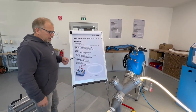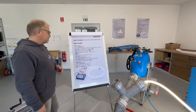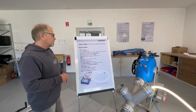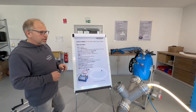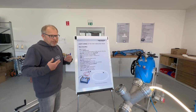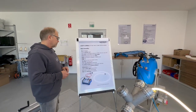We also made the standard E-modulus tests, and also here we have excellent results. All of them are more than 3000 newton per square millimeter. The TG is already from the beginning very high, so that means it is well cured with this light.